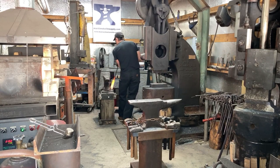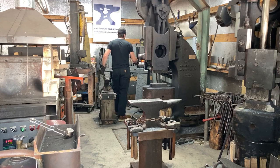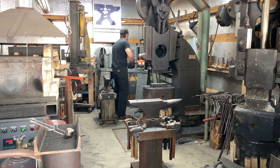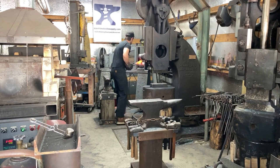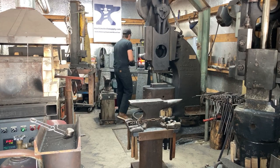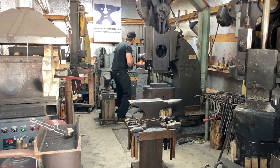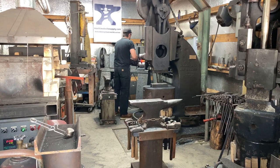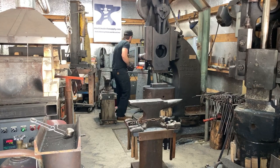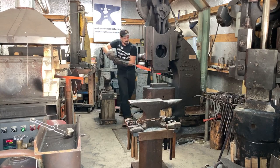Scraping some scale off here on the sharp edge of part of the anvil stand. Right here I'm using the rolling mill effectively as a set of kiss blocks, so I'm tumbling at 90, rolling it, tumble at 90, roll it, and sometimes I'll add just a little bit of down pressure and roll it